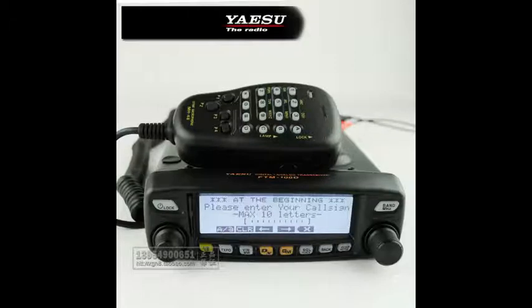But in HRI mode, which is what we'll be using most of the time, that doesn't happen because you lose most of the functionality from the radio itself. So in that case, you can press your AB band button, the very first button on the left. You'll get a lower beep, and then you will be in access point. At that point, if your frequencies are all correct and your radio is hearing your HT, you can then use your HT, go into Wires-X mode, and punch in a room number just as you would through a repeater.